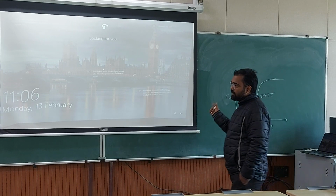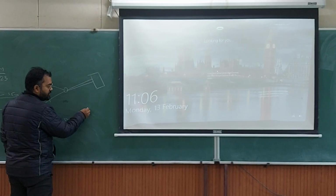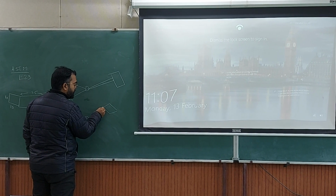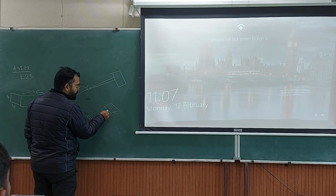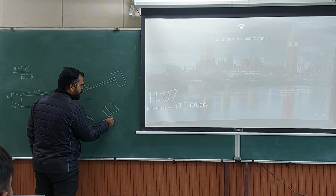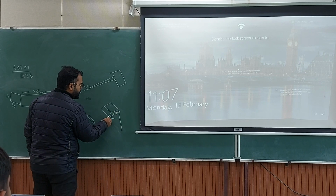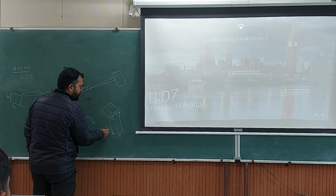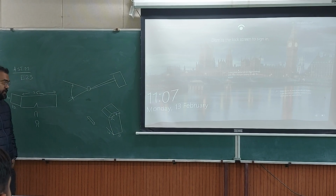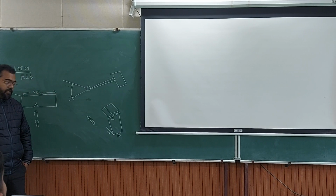And when you break these samples, on the broken surface you will see, as I said, that initially if you cut the sample, then you will have a notch region, and then you have this flat region. Usually this notch is 2 millimeter deep, so this is 8 millimeter, and this is the broken piece. So here you have 10 cross 10, and this is half of 55. The total length is 55, half of that. And so the hammer should hit from the back side, so this is a 3-point bend at high velocity.